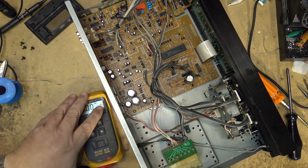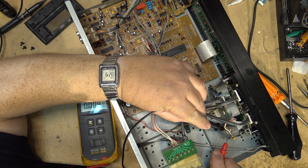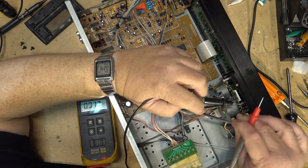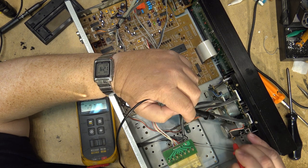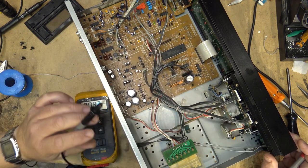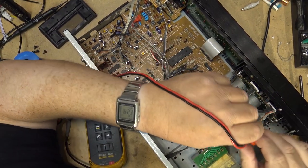When we apply power, now remember the red wire is negative. Okay, here's my meter. Red wire is negative, the negative terminal. Positive terminal here. I got 5 volts. Wonder why the power is so low. Let's unplug it and see what happens. Should have 12 volts there. I got 4 volts. Something else is wrong. I get the sneaking suspicion that this motor is no good either.